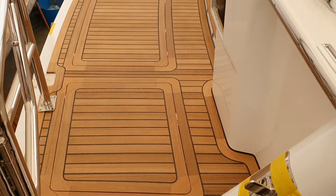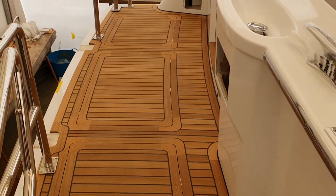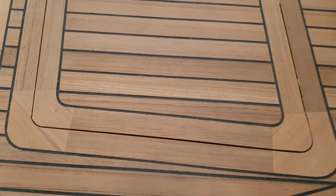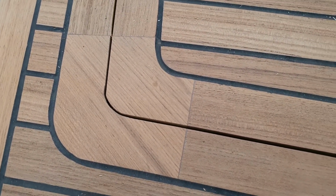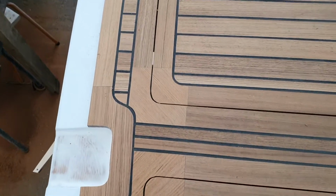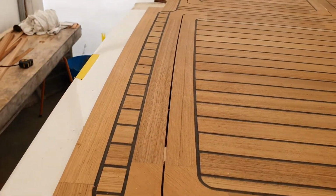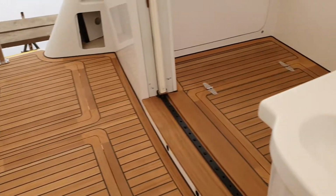All of those frames, all the margins are curved, so I've bent them, and then I've cut all the joints around them by hand. And as you can see, I've sawn the teak corners out of one block so the grain all matches. They're all the same. There's quite a curve on these rails if you look along. So this is the extension.